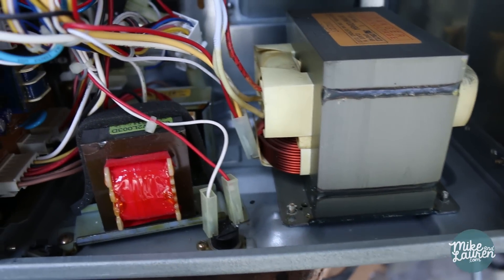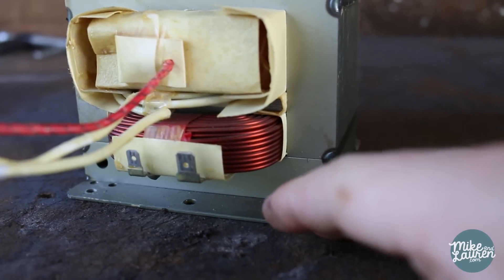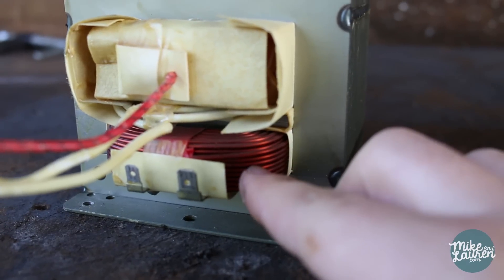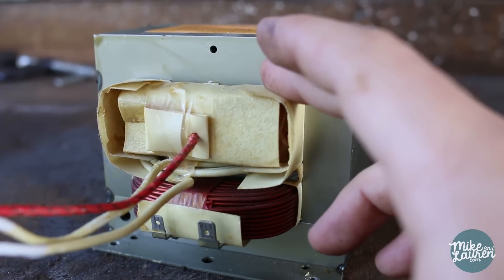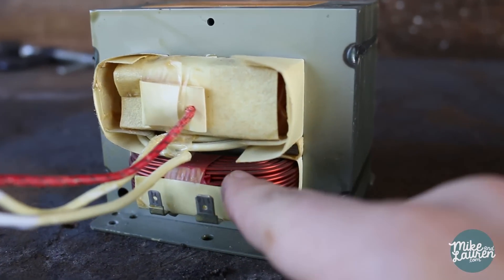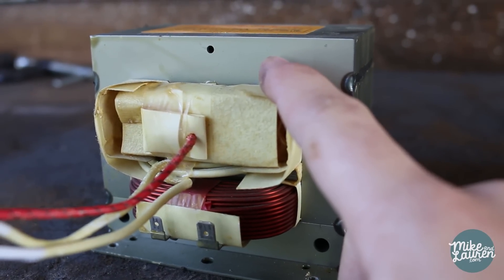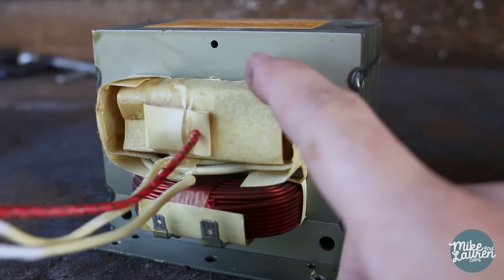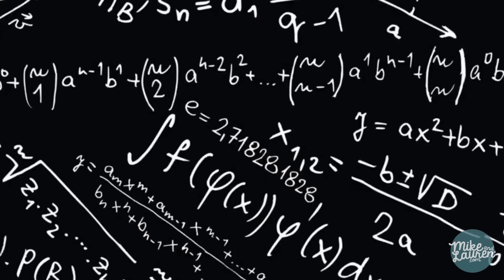At this point I'm getting really excited. You have two coils: your primary coil and your secondary coil. The number of windings determines how many volts it outputs, so it's very high voltage out but low current. We want the opposite of that for a spot welder, so we're going to keep our primary in place and replace the secondary with really thick gauge wire that will be very low voltage but very high current. This is severely oversimplified, but that's about the gist of how it works.